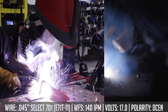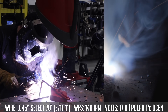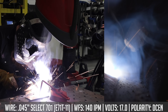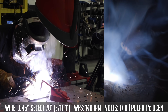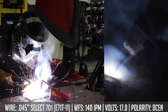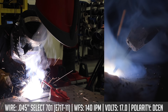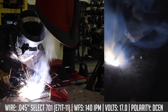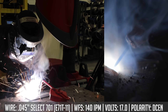I'm going to hold the wire at about a 45 degree work angle and a 10 degree travel angle. Because there's slag, you're going to drag. I'm welding left to right since I'm right-handed — just a slow, steady drag right down the material. You'll see I'm not blowing through it. A lot of people think flux core penetration will punch right through, but that's just not the case with this T11 wire. A T6 or T8 wire would blow holes all day, but T11 runs really well on thin gauge — it's what it's designed for.